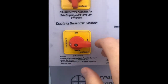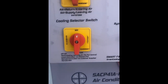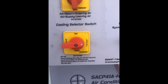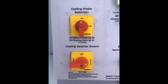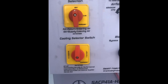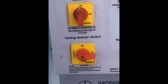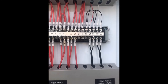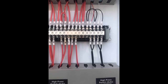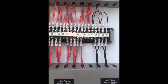So one more time, just to verify: in off mode, our compressor will never come on. In local, our onboard PLC is controlling the compressor. In hand mode, we're running manually. And in remote position, we need to close the contact from 61 to 62 to bring the compressor on and off. Thank you for watching this short troubleshooting video — please stay tuned for more.